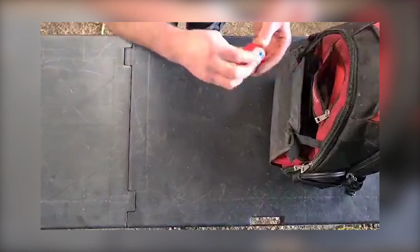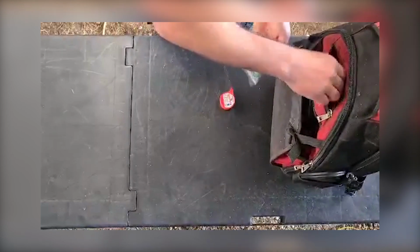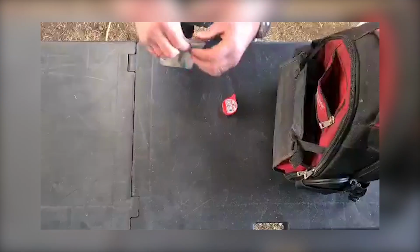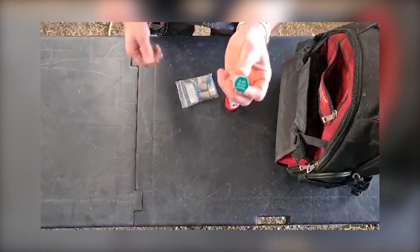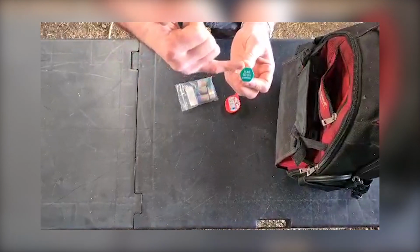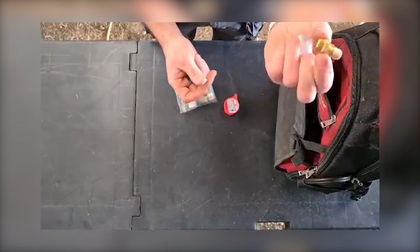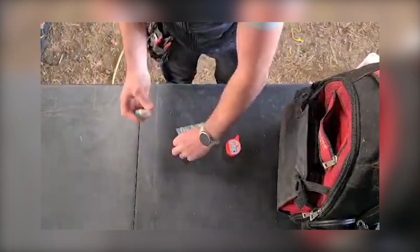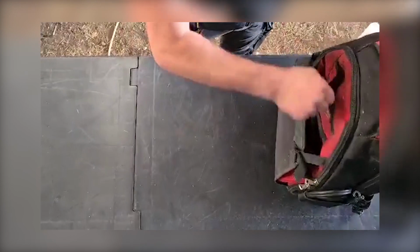Whip this little bag open, bit of Loctite, just a handy one there again, nice and handy in the hand. Any engineer will always keep a few oil nozzles spare, just general day-to-day nozzles. Again, whip these out. It tells you, replacing the oil nozzle, what grade it is, what degree and what it is, and whipping the nozzle out, just to show you quickly. They're just spares, usual day to day. If we do go to a boiler, we'll order the right one, but just keep a few spares, you never know, don't want to get caught off guard.